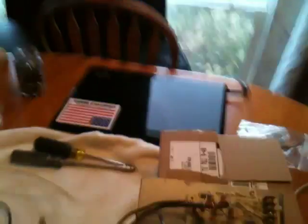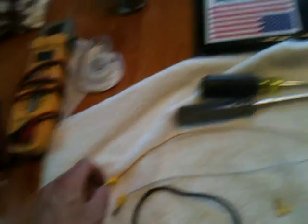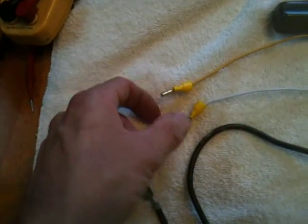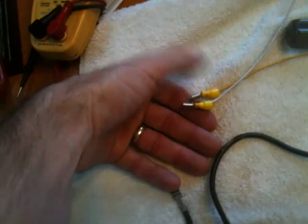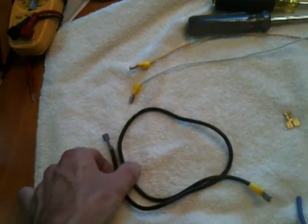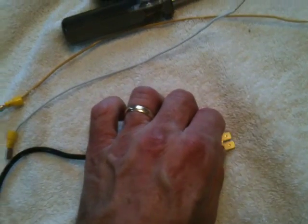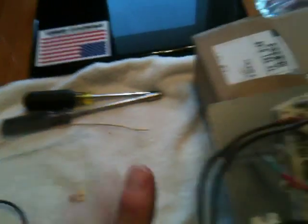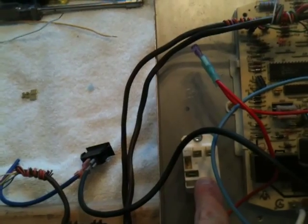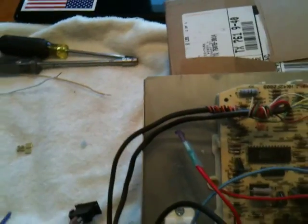Here's what you need — four things, actually five. You need two pieces of thermostat wire for the low-voltage 24-volt circuit, with push-on tab terminals on them. You need one heavy-gauge jumper wire capable of handling the amp load that the blower is going to pull. You need a little dual spade. And the fifth item, the all-important relay. I've just mounted this one here. Make sure the relay is rated to handle the amp load of the blower motor. This one is actually out of a heater, so I know it's rated at 30 amps.